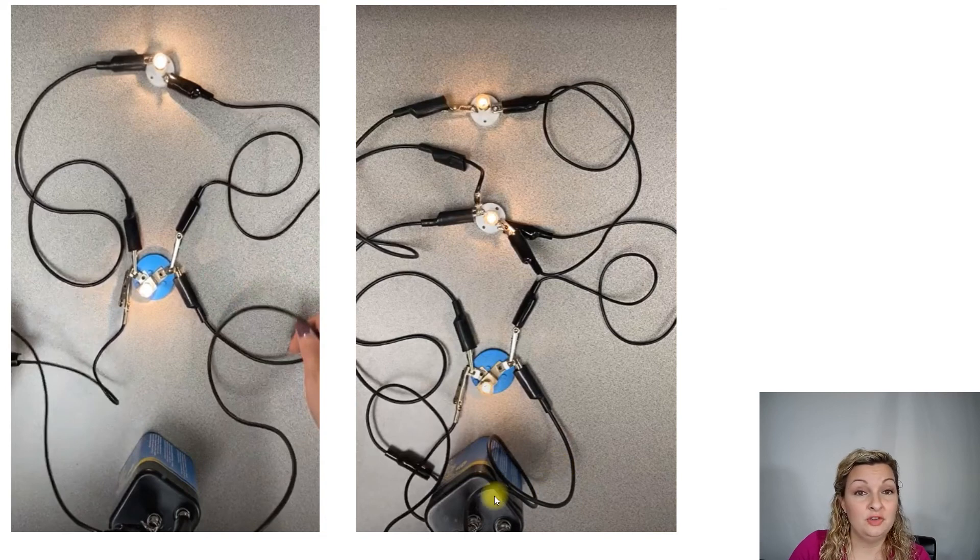That is because this is a six-volt battery, and in a parallel circuit each branch will receive a full six volts from that battery. With added loads — added light bulbs in this case — we are in fact decreasing resistance and increasing our current flow, so our light bulbs can stay at their full brightness at all times.